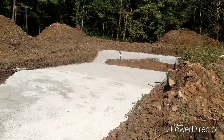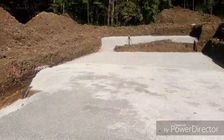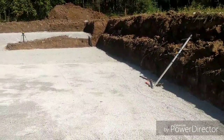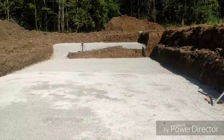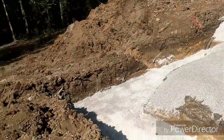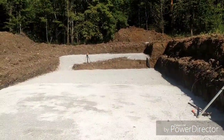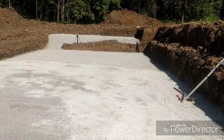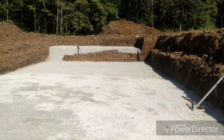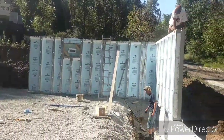After I give you a video here, we ran a little short and had to go get two or three more tons to finish it. It didn't turn out too bad, so they're gonna come in here in the next couple days and set all the walls up. That's what we do for superior walls. We've got to come back and make an extra trip to backfill this frost footer once the walls are in. Then once they pour the basement floor and get the house set, we'll come in and backfill all the rest of this and the garage. They're setting the walls — that's it here.